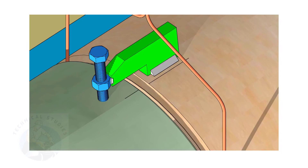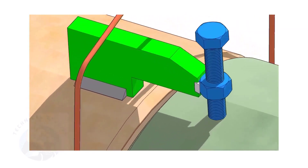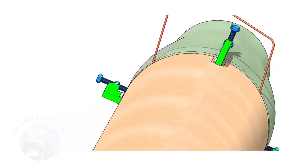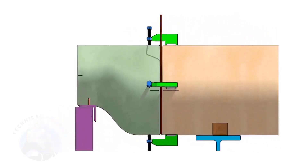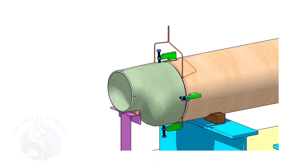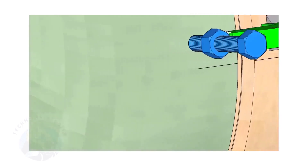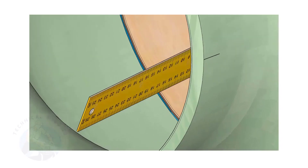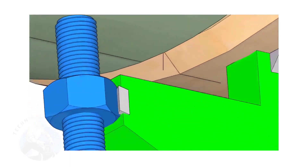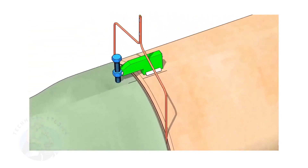Put the gap rod in the joint. The gap shall be 3 millimeters to 4 millimeters, depending on the welding process. Match the center lines on the pipe and on the reducer. By adjusting the jack bolts, correct the overlap of the joint inside the pipe. Now, tack weld on the top side of the joint.